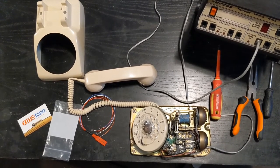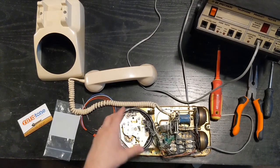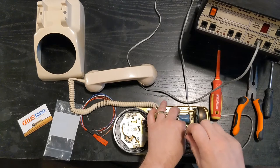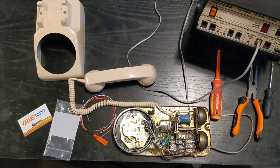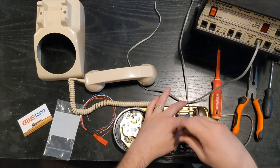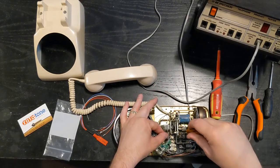At this point the polarity guard is in place, and we need to disconnect the dial from the network and install the diode. I'm going to slide this dial back off. The first thing we're going to do is grab this blue wire off of F — remember that wire I was just telling you about? It's coming off. We're going to take the green wire from the dial off of RR as well, and while I'm doing this we're just going to tighten up our screws to make sure nothing else comes off. So there is our green wire on RR.